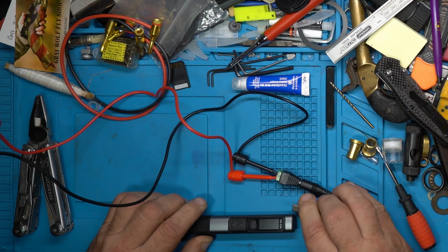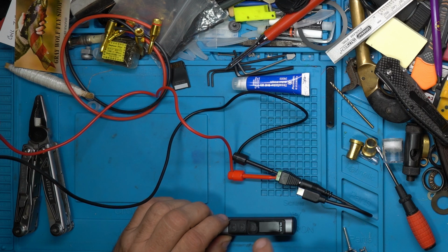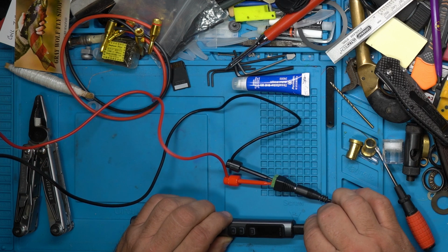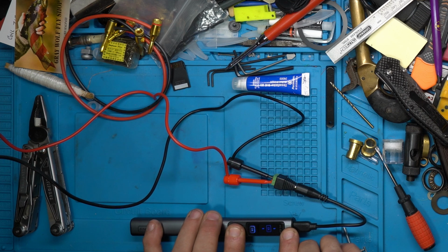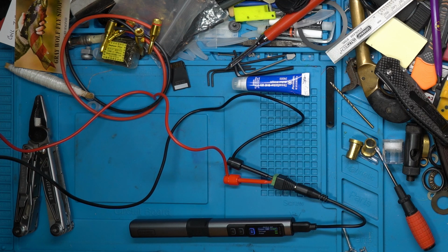So you can see, I think my highest wattage was 57 watts that it drew during the test, and it was 2.9 amps. And it didn't trigger my over current protection, so it didn't go over 3 amps. All right. So let's plug it in and see what percentage it's set the iron at. 96%. So it set the iron at 96%. So it is saying that it should be able to start at 96% with the settings the way they are set at 20 volts. And I believe it because we did a test like that and it came up without a problem.